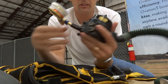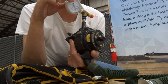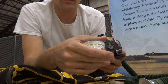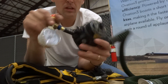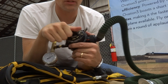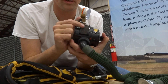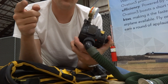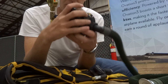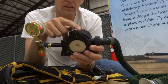This is the A14 regulator. You can see where the hose comes in to the regulator. We've installed a second pressure gauge so that the bottle can be remotely mounted and the pilot can see how much pressure is left in the bottle and get confidence that the system is still functioning as intended. The cool thing about this regulator is it has two functions we like to use. One is the regular diluter demand system, where it mixes cabin air through this opening with oxygen according to a pre-scheduled gain set up on atmospheric pressure. As you go up, it senses atmospheric pressure going down via a small altimeter inside and gives you a little more oxygen, mixing that with the cabin air.